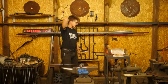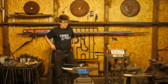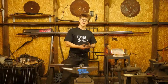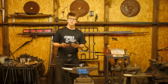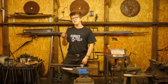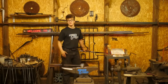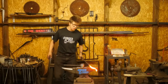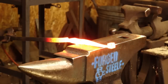Daniel Mosler has asked a good question on YouTube. He's asked me what I think is better, a steel stand or a wooden stand. It's not like a romanticism that I prefer steel over wood. What it is more so is that I just want my anvil to be as immovable as possible and give me as much return to the hammer blow as possible. I also want to be able to get in close. And I like the idea of having it immovable, yet relatively portable. Because ain't no damn forklifts around here in the workshop. If I want to move my anvil, I want to be able to move it myself. Based on those things, I like a steel stand the best.